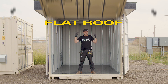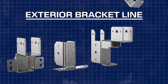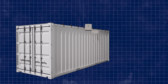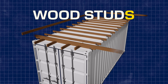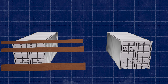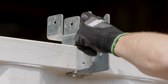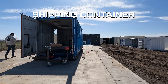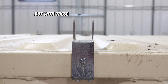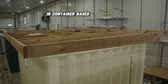Why in the world would my customer want a flat roof on top of an already flat roof shipping container? We have our new exterior truss brackets which go along with our exterior studding bracket product line, and that allows you to use wood studs to build a roof on a single shipping container or span across multiple shipping containers. Right here is something we came up with utilizing these brackets, mixing wood construction with shipping containers. I typically hate wood studs but with these exterior studding brackets I finally found a purpose for them in container-based construction.